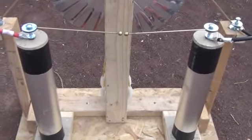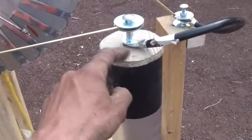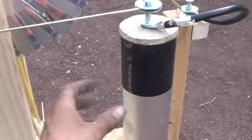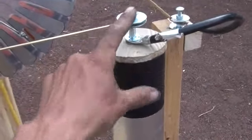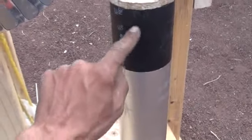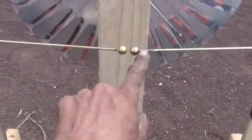I just want a very high voltage discharge out of the ends of my points here. You can tell we've got our discharge balls mounted off the top of our capacitors. Out of the center of this bolt — which I'm going to show you here in a moment — I've got a set of wire brushes that actually go down and touch the inside piece of aluminum foil, connecting a circuit from this bolt to the actual inside piece of aluminum foil, wrapped at exactly the same height. That's coming off of here, both to our discharge ball on this side and then going back to our comb.